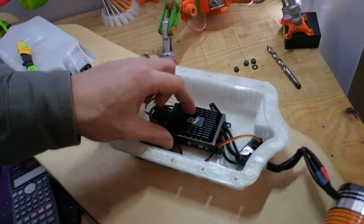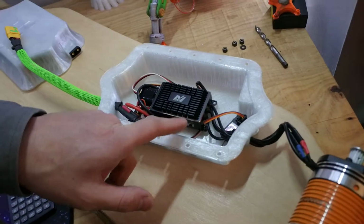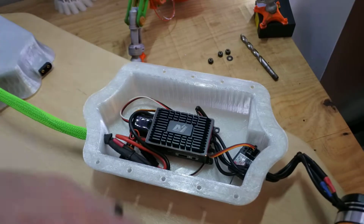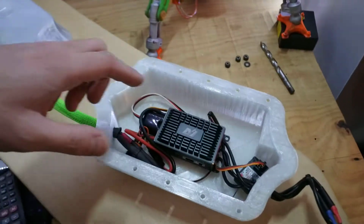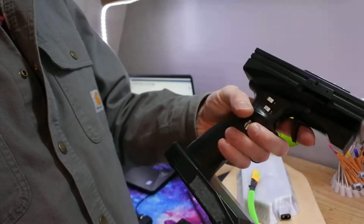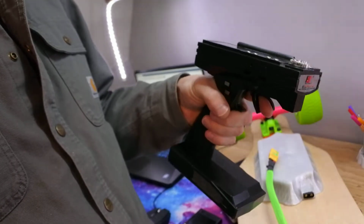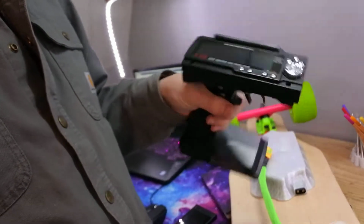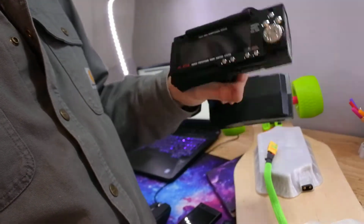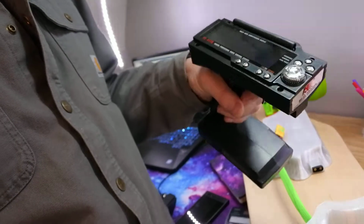As for electronics, I have a VESC, specifically made for electric skateboards. It's 100 amp constant and 140 amp burst, I think, if I remember correctly. Running the latest firmware now, updated it last night. As control system, I'm running a FlySky receiver from an RC car setup. I just removed the steering wheel, effectively making this one channel, for go and, not reverse, sorry, but brake. Configured that to it. Hoping in the future, because this has more capabilities than the standard electric skateboard stuff, that I can run telemetry for voltage from the batteries and stuff to the controller.